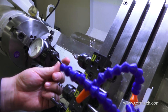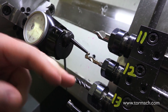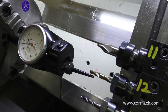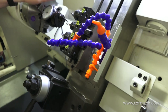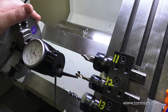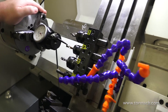I'll adjust my indicator a little bit to make sure we push on the drill. I'm going to make sure I always spin this in the counter-clockwise direction. The reason is that if I spin it clockwise, it'll hook on my drill like it's trying to cut, and I don't want to get hooked in that helix groove. So I'll always rotate it counter-clockwise. Now you can see I'm way off, so I've got to get closer. Sometimes it just takes some eyeballing to get it reading. Now I'm at 2 on one side and around 14, and on the other side I'm under 2 but closer to 45 — so I need to get somewhere around the 30 range.